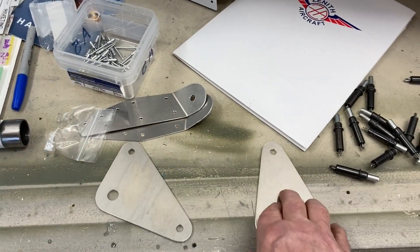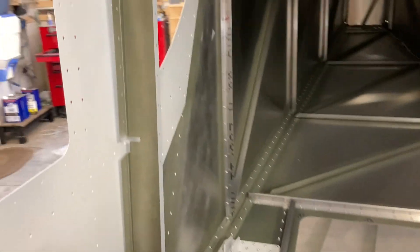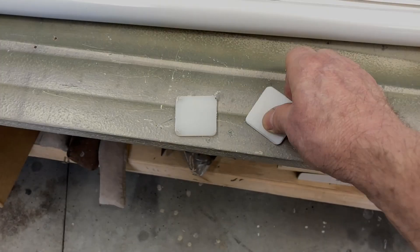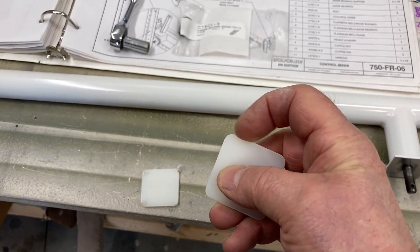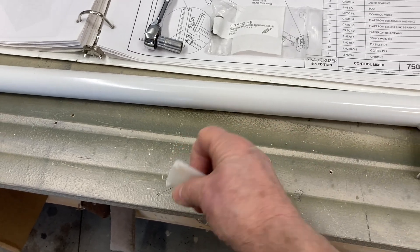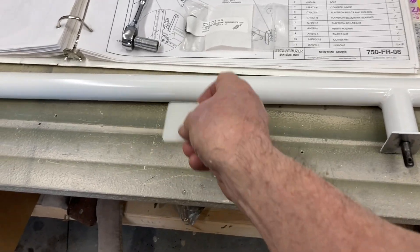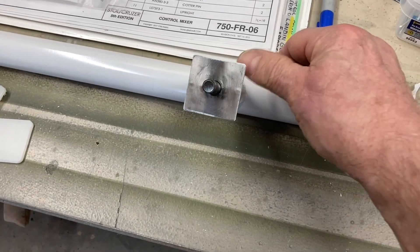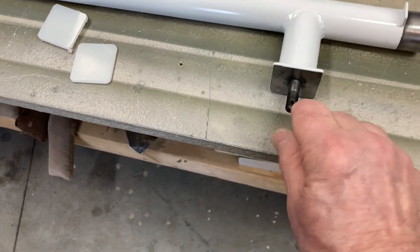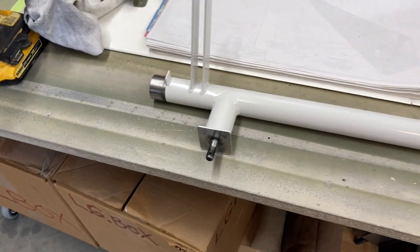I'm going to leave these kind of a polished look. After I get it painted I'll be putting these in. At this point I just got to put these sides in and rivet the bearings in, and then that'll be done. I've been sanding and cleaning up these edges — I don't think I want to leave them 100% pointed in case they turn and that point catches on things. I'm beveling the edges so that they can spin freely. It's quite a bit of messing around, but just like any other part, you just got to take the time to clean it up, mark the centers and get those drilled. I took this on the sander and beveled the edge on the points here so they're rounded over quite a bit — things will not want to catch as it's turning. They're nice and clean, lightly sanded, and they'll receive grease and be assembled.